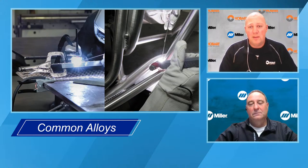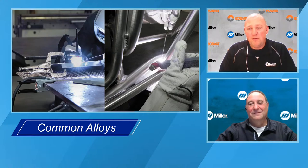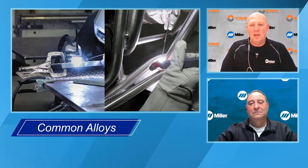Like if you have a spool of wire that somehow the label got ripped off, there's what's called a ring test. I was going to do it on this live stream, but unfortunately the sound doesn't come through real well. But if you take a small piece of 4043 and drop it on a table, it'll make more of a thud sound. The 5000 series wires, because they have a high magnesium content, work harden when we draw them down, so it has more of a ring.